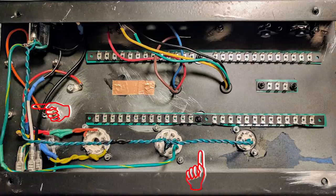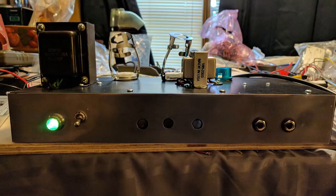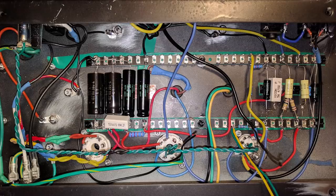Like in my basement build, we twist the filament wires to cancel noise, and we keep the wire runs elevated above the sockets, just like Fender used to do. This time I'm building the circuit with terminal strips. While fiberboard or turret boards are more authentic, terminal strips are cheaper and they also allow more flexibility in how we'll ultimately build the thing. A quick test shows the power transformer seems to be working, so it's on to the next steps. Here we have the completed circuit. On this side is the actual audio part — pre-amplifier, volume, tone, etc. This is where signal comes in from outside the amp and gets amplified. On the other side is the power supply. The power transformer takes AC current from the wall, changes it to DC current the amp can use, and then this set of filter capacitors stops the converted power from jittering around like a caffeine addict.